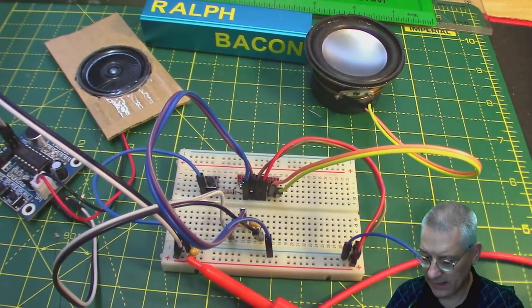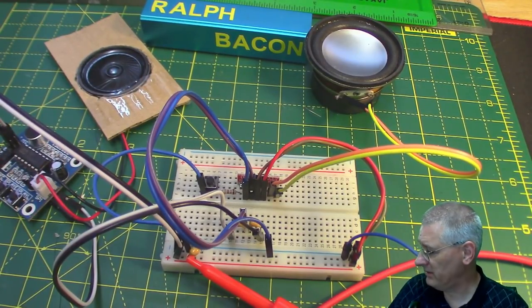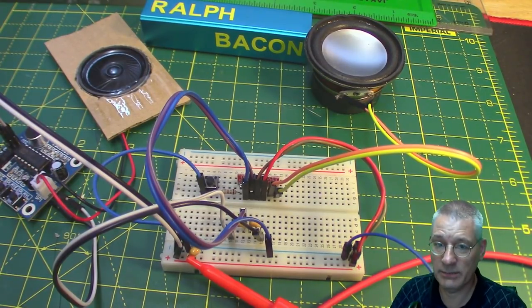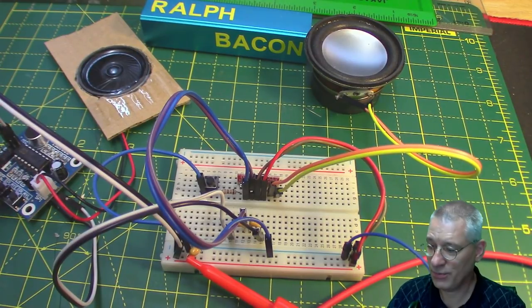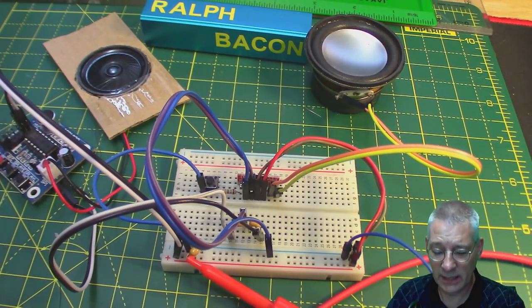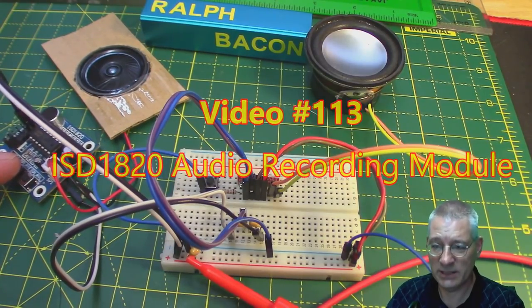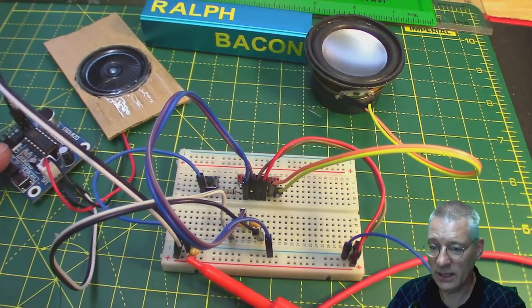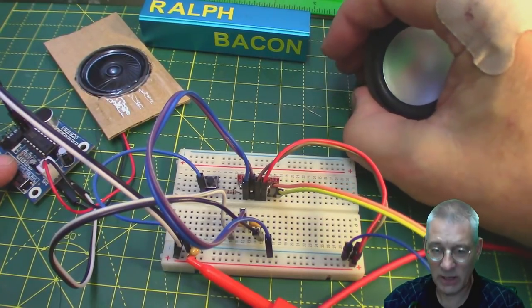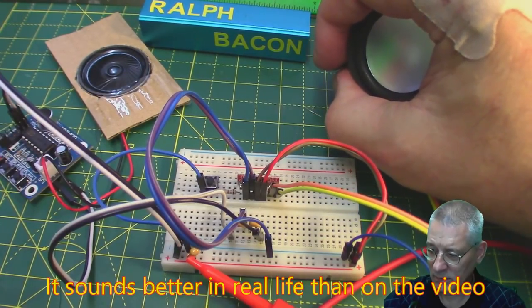It's all connected up — 5 volt power. I've got the current limited to about 500 milliamps. It does take quite a bit of power at full volume. If you want to know more about this recording module, have a look at the video — we go through it in the nth degree. As I say I was a little bit disappointed with the volume before, but now listen to this. I'll make a tube out of my hands just to make sure the microphone picks it up.